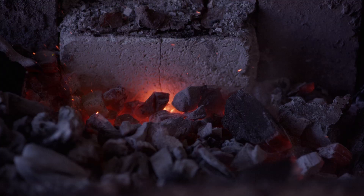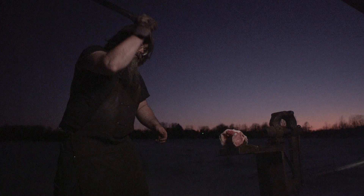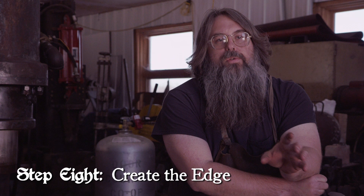That carbon is trapped inside that structure. And by reheating to a lower extent, we allow some of that carbon to escape back out into other structures in the steel, and that takes the brittleness away and gives us a functioning edge. Following the quench and temper, you still have to create the edge on the sword — so it was scraped down to a clean finish. Sometimes they use stones or steel scrapers to refine the shape, and then it was polished because a polished sword cuts better — there's less resistance.